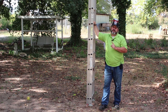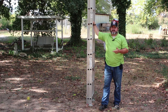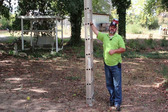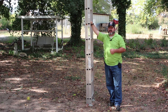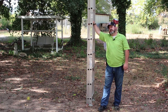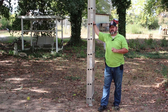If you're going to carry the ladder vertically, look up. Make sure there are no low-lying branches, limbs, electric lines, cable lines, phone lines, string, rope — anything that could catch the upper portion of the ladder and throw you off balance. You can seriously hurt your back from just a simple piece of string catching the top of the ladder. Once you've walked your path from point A to point B and checked for hazards, it's time to transport your ladder.